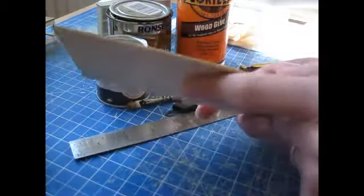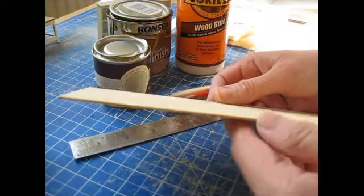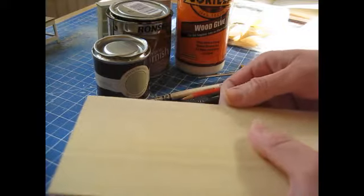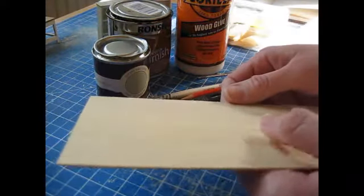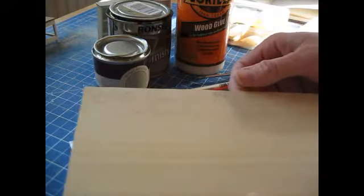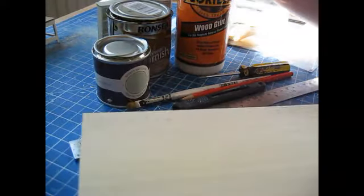For this project I've used a softwood called Obéché, spelled O-B-E-C-H-E, and I'm using three different thicknesses: 1.5mm or one sixteenth of an inch; 2.5mm for the top and bottom of the piece, which is 3/32 of an inch — though you could use 1.5mm for that too; and then a really thin veneer, less than a millimetre thick at 0.87mm, used just on the front of the drawer.